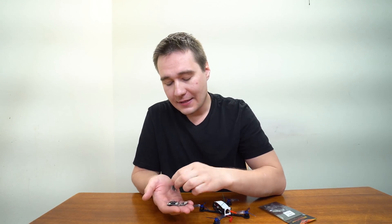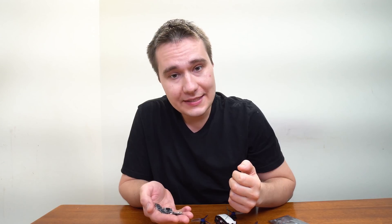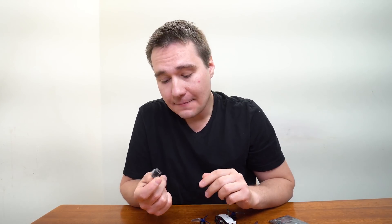I thought I'd use the Happy Model flight controller since nothing seemed wrong with it. I decided to use the same wiring diagram I use with the Tiny F3 flight controller we sell paired with the Cicada, because the speed controller supports 1S and 2S batteries while the flight controller is only 2S. I used a Pololu to feed 5 volts into the flight controller with the battery connected the regular way. The first hint of trouble was when I connected USB and the speed controller got initialized — I could spin motors just on USB and thought it was a cool feature. Then I connected the battery and got white smoke. So I fell back to my favorite Tiny F3 with OSD flight controller, using a proven method that worked for many quadcopters I've built.